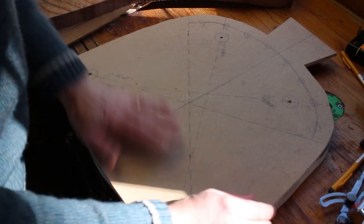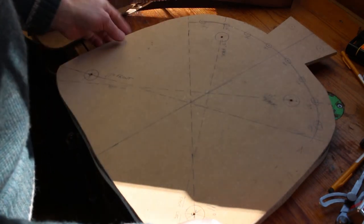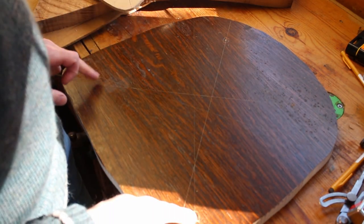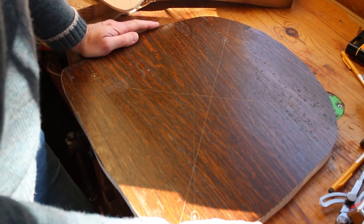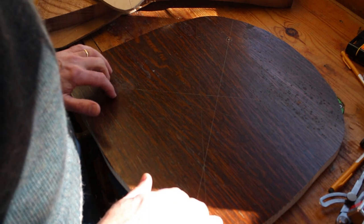I've just drawn up a new seat template — I decided rather than trying to work off two templates it would be easier to have one, so I've worked out my seat angles and spindle placements. I've also roughed out an old bit of wood into the main seat area — not the back comb but the seat area — and I'm going to do a practice drilling just to see if I've got these angles working nicely. I always quite like to do this; I look out in skips for bits of wood suitable for trialing things. It's just a bit of blockboard but enough to check my leg angles.